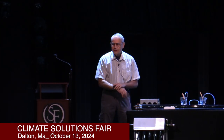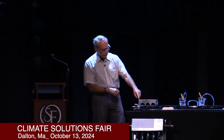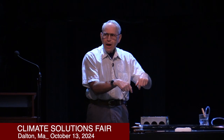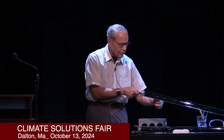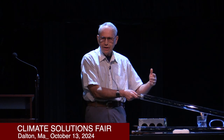She's asking about reverse transfer — how it keeps from getting back out once it's in there. Why does the heat stay in? The vacuum. The radiation from the sun will go through glass. Once it heats everything up inside the center of the tube, that heat won't go out through the glass because there's a vacuum between the two layers of glass, and there are no molecules to conduct the heat out.